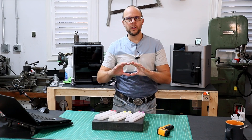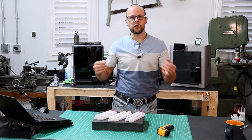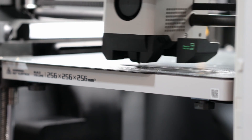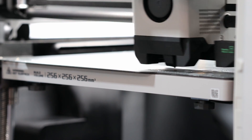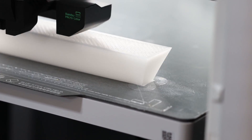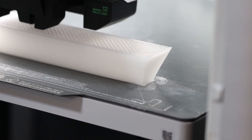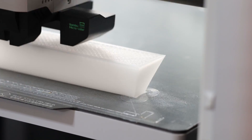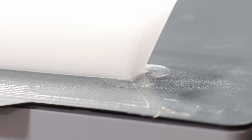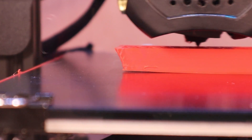The final three tests are heavy prints with the door completely open, which creates a lot more airflow and dramatically lowers the chamber temperature. The factors we have to contend with include: a heated bed and glue stick for good adhesion to the build plate. The heated bed also provides steady warmth from below, helping the print from cooling and shrinking too much before finishing. If enough force is applied, the build plate will actually come off the magnet just a little bit — and this is partly why most people don't even know their prints are warping, because it's really hard to see. After enough layers are deposited, the strength of those layers helps resist further warpage.